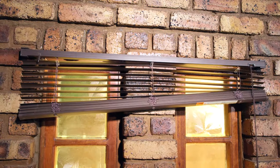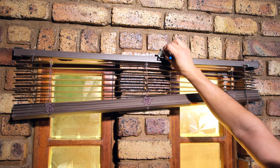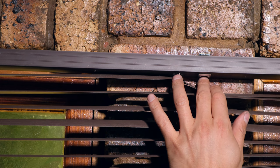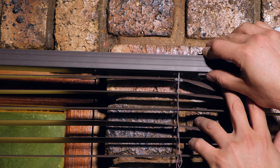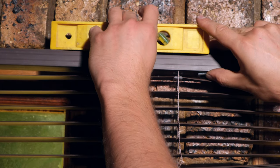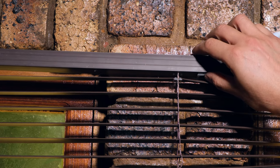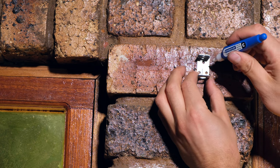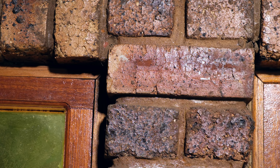Now I can insert the blind. The next step is to align the middle piece — it goes underneath and round. I insert it in here and mark off where the middle piece would be using correction fluid. If your blind is very wide it might have already sagged, so you may need the spirit level before marking to confirm the position is still level. My blind isn't very wide so it's not sagging much. Now I drill that hole — my blind is small so I'm only drilling one hole for the middle bracket.